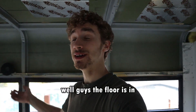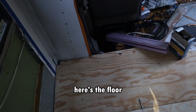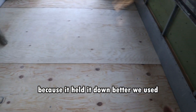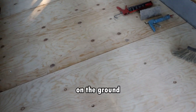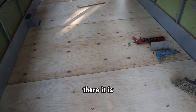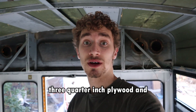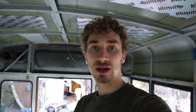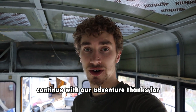The floor is in. It went in pretty smoothly once we knew what we were doing. Here's the floor, all the way up to where we put the foam. We decided to use screws also with glue because it held it down better. We used pretty long self-tapping screws so that it stays on the ground without coming up. It's beautiful and solid. We used three quarter inch plywood and one inch foam. Check down the description for the tools and materials. I'll try to link as much as I can down below. This is very exciting and I hope you continue with our adventure. Thanks for watching. I'll see you next time.